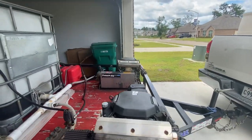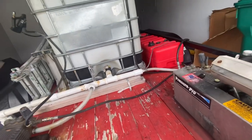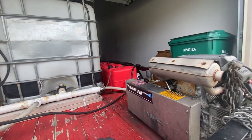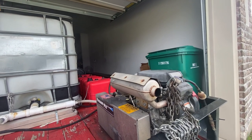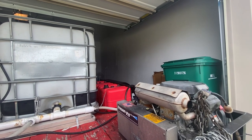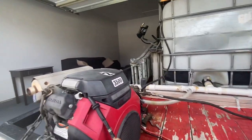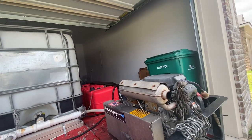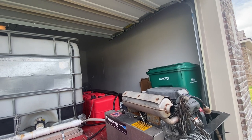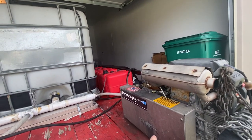Let's talk about these two machines up front. If you're going to mount two eight-gallon-per-minute machines, a couple things you need to think about: thermal transfer. The exhaust comes out right here, so you need to watch that exhaust — however you configure your trailer, your exhaust needs not to be blowing on your water tank, definitely not your gas tanks, your battery box, or other equipment. That exhaust can heat things up five to six feet away to unbelievable temperatures — you wouldn't want to touch it with your hand.